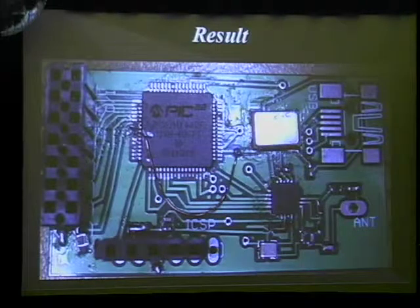However, every single time I tried to program it, it kept giving me the error that it couldn't program the boot sector, or sorry, it couldn't program the configuration sector. I actually never solved that, and I've switched since then to using the PIC microcontroller that I've actually used before and has been comfortable for me.